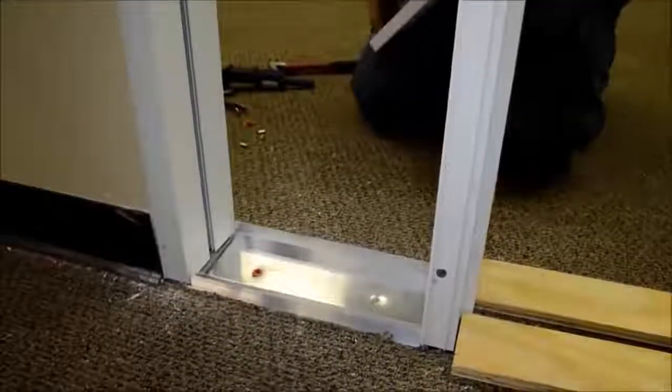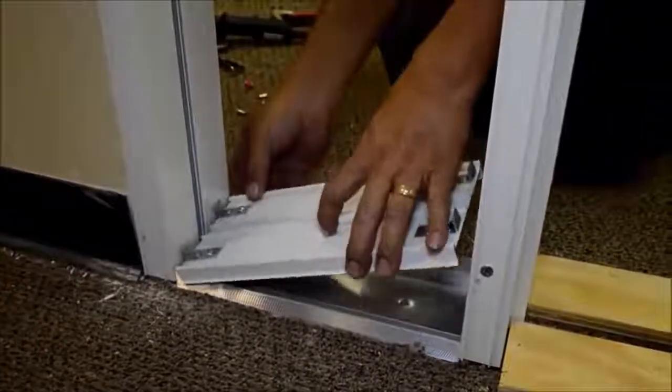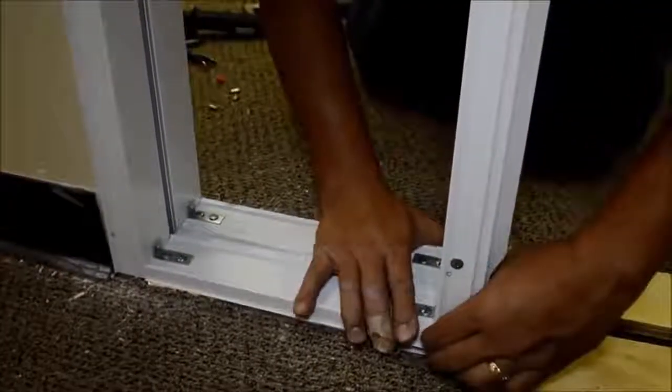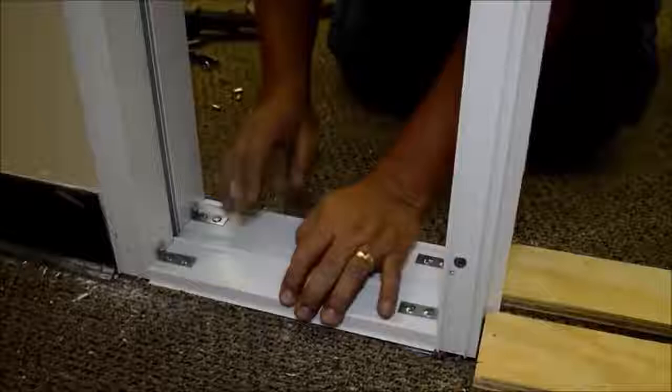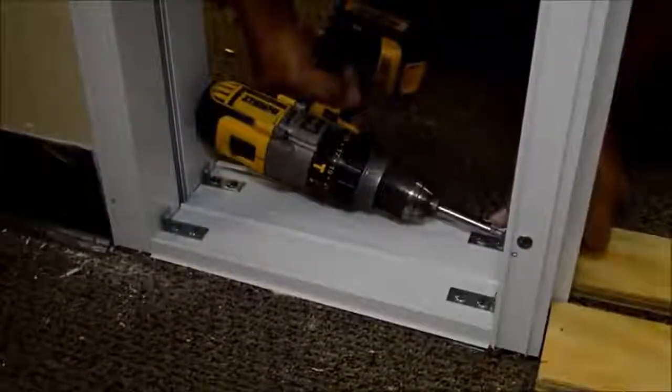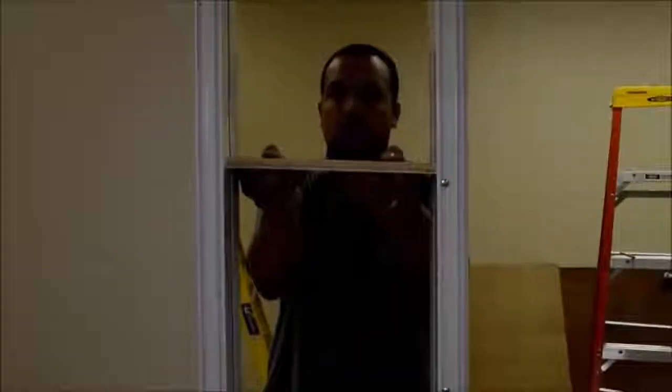Next, slide the base over the setting channel and attach the C406 clips to the vertical mullions. Once all the horizontal components are in place, ensure a square opening prior to installing the drywall screws in the outside glass jamb.